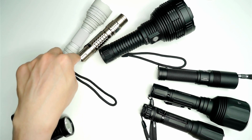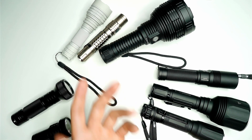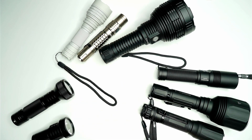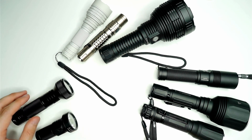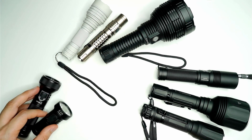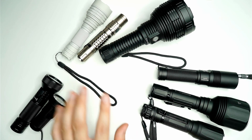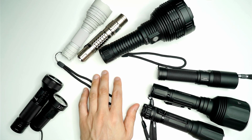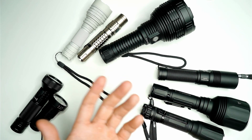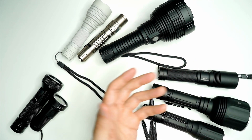With the FC12 you've got two buttons — one on the side and one tactical switch on the back — and you can toggle between smooth ramping and step ramping. You've also got a strobe mode and a moonlight mode on there. The TIR lights have quite similar UIs to the reflector flashlights, often also coming with a lockout mode. So you've got a lot more options in terms of UI. Some also come with a moonlight mode — something that LEP flashlights do not have and there's not really much you can do with an LEP on moonlight mode anyway since there's no spill, making them more specific-purpose.